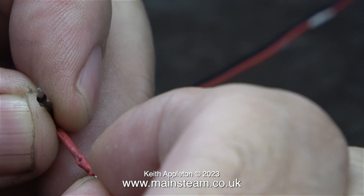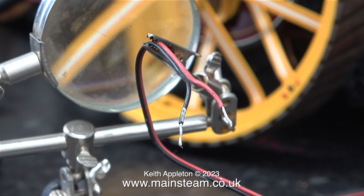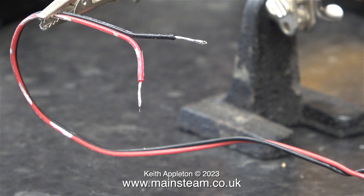This is something you may not have thought of: if you hold the piece of insulation in the crocodile clip too close to the heat source, then the heat of the soldering melts the insulation and it looks very unprofessional. It's important to always hold the piece of wire well away from where it's going to be getting hot — hold the wire in the crocodile clip just like you would if you were holding it in your fingers. You wouldn't be able to hold the insulation so close to the heat source. After melting the insulation on purpose in the first attempt, I just started again and cut the wires to the same length, then repeated the process.